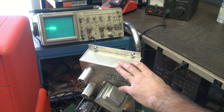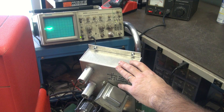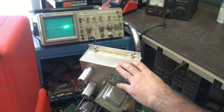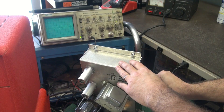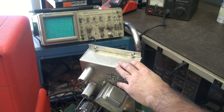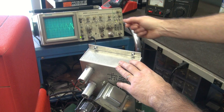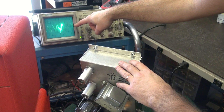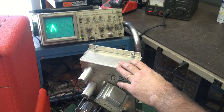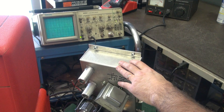So for a little comparison of noise levels — I've got the KT-66s installed. I'll bring the volume up and you watch on the scope. I put the volume around three quarters of the way. I'm at 0.1 volts per division. So we've got about two, two and a half divisions — we'll call that 0.25 volts.